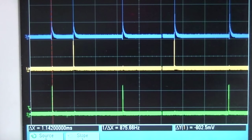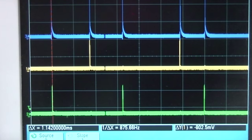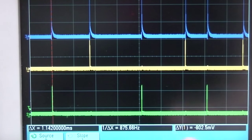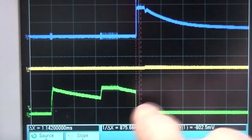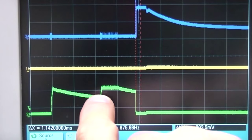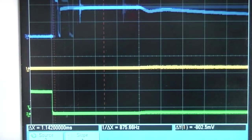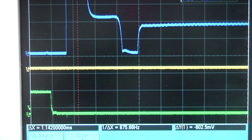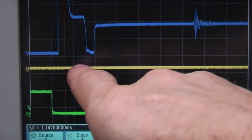It took quite a lot of poking around to get some useful signals out of it. I was expecting to see it sending a burst of ultrasonic signals and then looking for a response, but actually it's quite a bit simpler than that. What you're seeing on yellow and green are the two transducers - it's pinging them alternately with this random delay time. Looking at this in more detail: all it's doing is charging the transducer up to about 50 volts and then very suddenly discharging it to create a ping. It's basically just shorting the transducer out to generate the ping. This top waveform is from the received circuitry - it goes a bit nuts from the transient, then it settles, probably using an input clamp to deaden the transducer and stop the ringing so it can then look for the received signal.